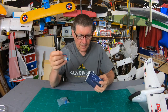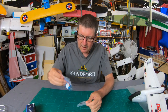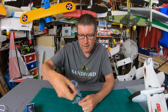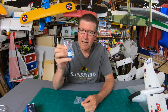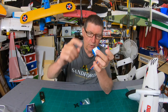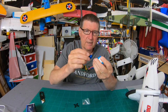They are more expensive, but if you want a better quality motor, that's what you would go for. This one is the short shaft version of the 2216 1250KV motor. The 1250 comes in short shaft and long shaft versions. The short shaft version has no shaft protruding from the motor and you bolt on the threaded shaft, which I much prefer these sorts of adapters.